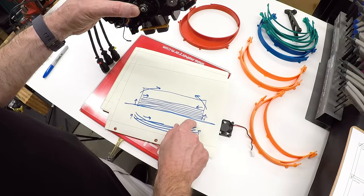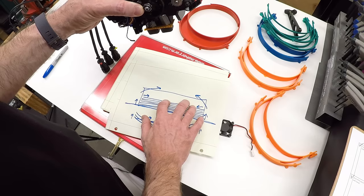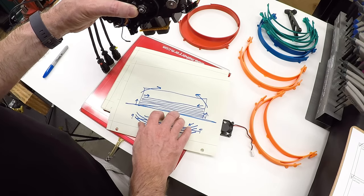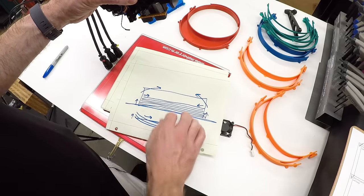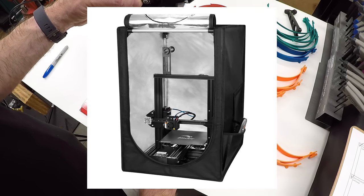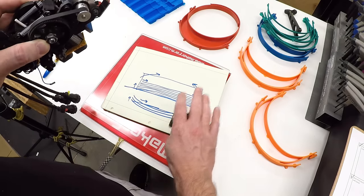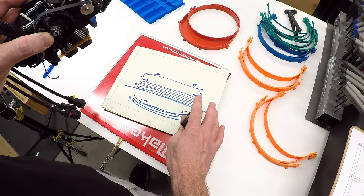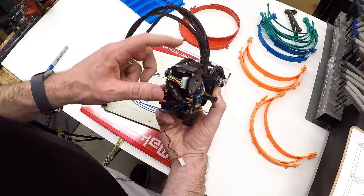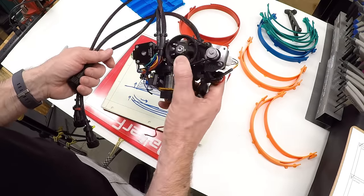Any cool air is just going to make the adhesion problem worse. Will that one factor destroy your print? Maybe, depending on the circumstances. But anything you can do to keep the thermal life cycle of the part as stable as possible — so you don't get a lot of cooling up high during the print — the better. I've even done things like put foam board around the sides of the printer to create a pseudo heated chamber. You can buy foil-lined, fireproof tents that go over 3D printers to try to reduce this. Keep in mind, if you trap too much heat, depending on the design, you may start melting things — the motors on my extruder run fairly warm and are bolted to an ABS plastic part, so increasing the temperature around them could cause the plastic in the frame to slump.